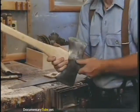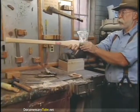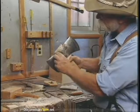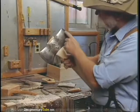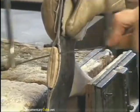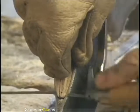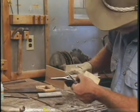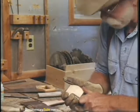Put it back on — now would be a good time to sight down it. Looks like the edge is in line, so it's going on square. Now that we've driven the handle all the way home, you'll notice that the edge is a little bit uneven on this side. We just cut this off rough — the important thing is that it's square and that the edge is in line with the handle. Take the coping saw again, follow the contour — be careful at this point so you don't break it. There it's trimmed off perfectly flush. If you look at the edge here, it's pretty thin and doesn't have much for expansion, so in order to get the wedge down further, I'm taking some of the thickness out of it.